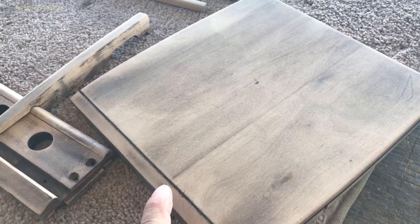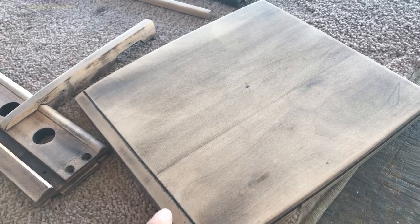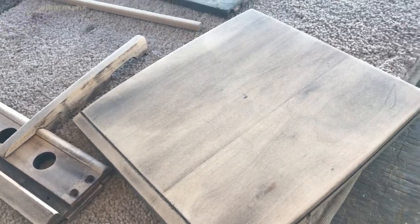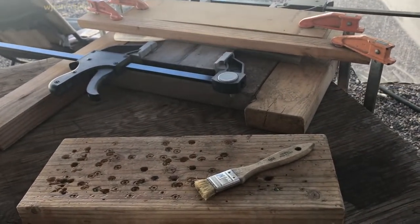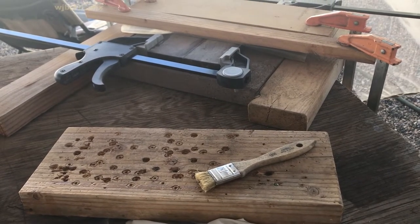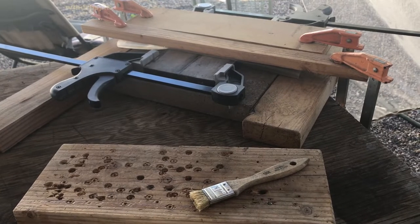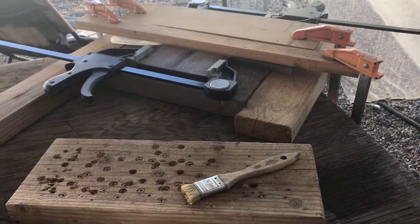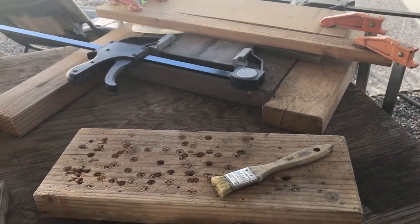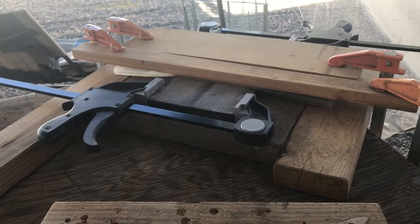That was the end that had the bow in one of the pieces, so I had to break it apart, put it in a jig on the paver, and seriously crank it down with the heavy clamps. After wetting it with water and letting it sit for a day, it did press out the bow in the wood. Now I've got it in half pieces — those two pieces right there had the bow in them.